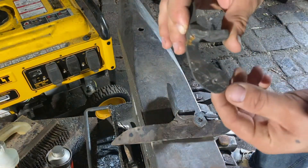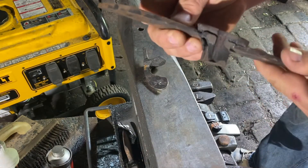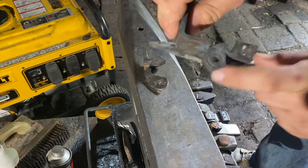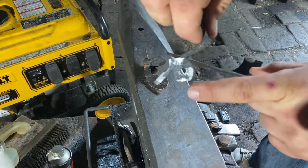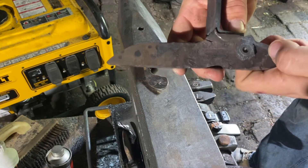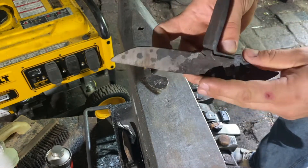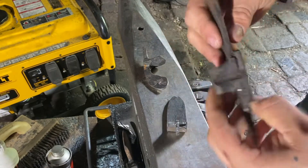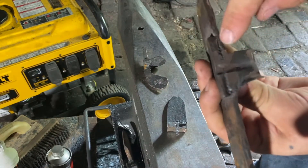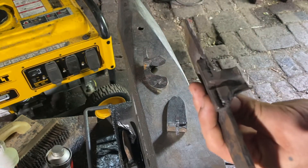I found the center where I want to drill the hammer. I've been doing lots of cleanup up top — I cut a notch right here, cleaned up where it twists, and smoothed up the back face. I got the whole center punched where I want it. I've been doing some peening on this to help raise that lip up. I'm going to try to fill these gaps from welding where the bar mushroomed on top with solder and flatten it all back out so no powder can get in there and come straight back at me.